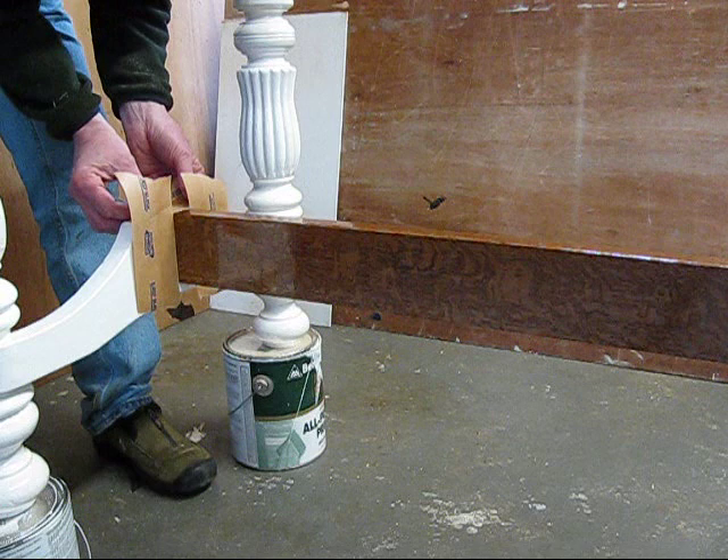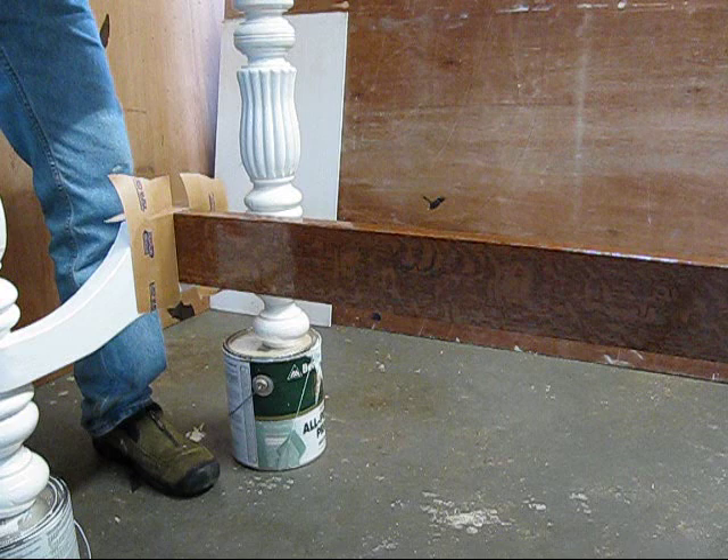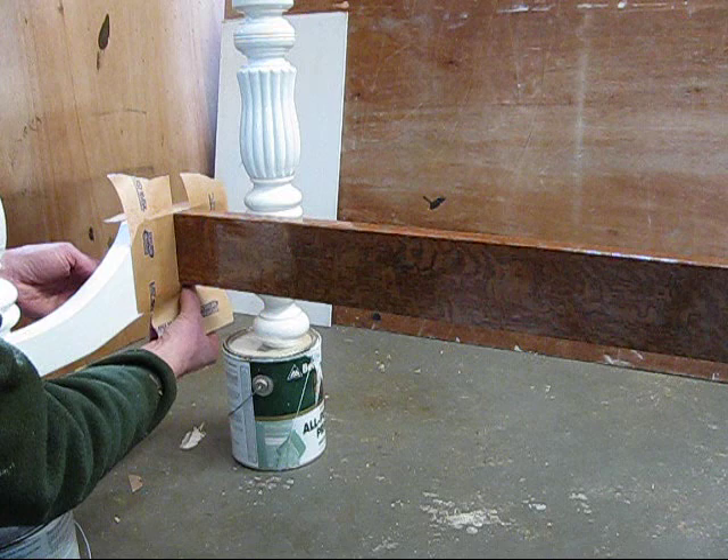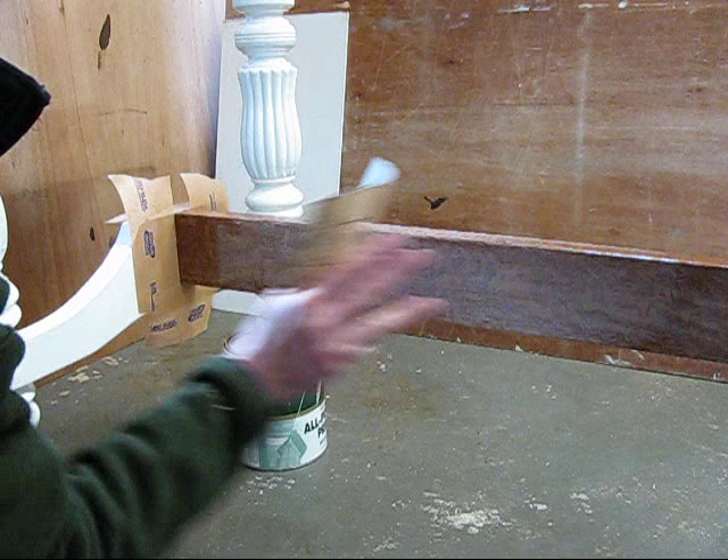The center brace now has three coats of polyurethane on it. I'm putting some wet paint tape on to protect it from when I sand the polyurethane — I have to sand it lightly with 220. Then I'll leave it while I put the fourth and final coat of polyurethane on.